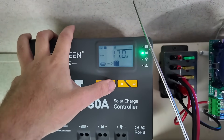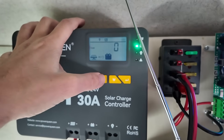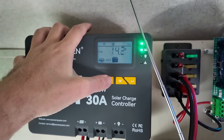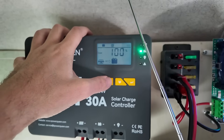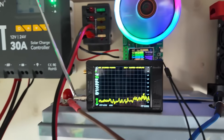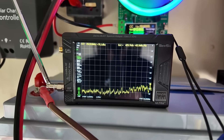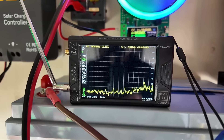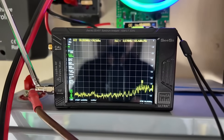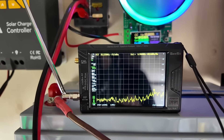The battery is now plugged in and the charge controller is going to have to figure itself out. Is this battery full? We're putting 17 amps into the battery — that's good sun, but not a whole lot of noise. E00 means no error, no load, no load amps — the battery's in float mode: 28.5 volts from the solar, 14.2 volts to the battery, battery's full, and we're putting 17 amps into it. It thinks the battery's full because I just plugged the battery in and it ain't smart enough to know what's going on. It's easy to disconnect this while looking at the SA — I can do that one-handed. So we're at minus 70. You see that number one marker floating around there, and I just unplugged, and we're still at minus 70. So it's not minus 95 like it was without the charge controller in the room, but minus 70 is still pretty good.